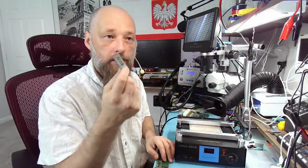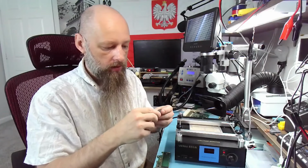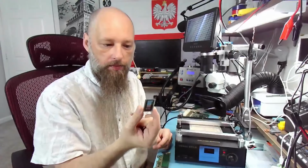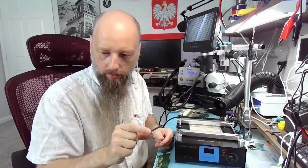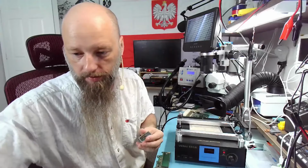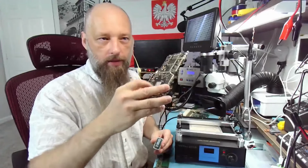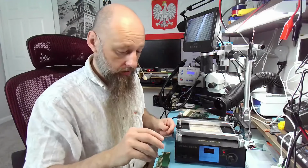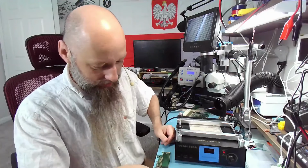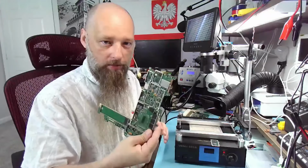And I was actually thinking, so what's wrong with this one? It's not the CPU that is shorted. It's the PCH. And unfortunately, the PCH is embedded in this big chip. On Surface Pro 5, even though the chip is even smaller, not only the PCH, but the EC is embedded there. So the only external component is a SAM chip, and it's on the other side of the board. So Surface Pro 5, not very repairable. Surface Pro 4, very much so.